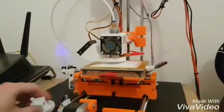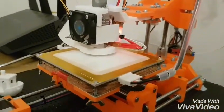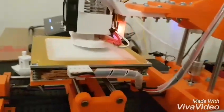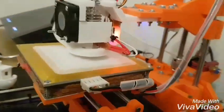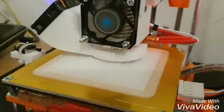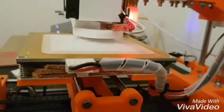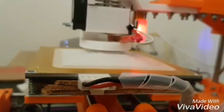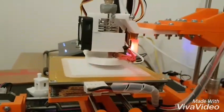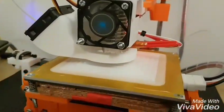Subsequent to the Benchy, we've got another little calibration test on the Atom X. This is like a pyramid — a very shallow pyramid. I'll just be able to measure whether it's 10, 20, 30, 40, 50 mil across. It's an 80 mil square. You can see it's flat as a pancake — the auto leveling is working perfectly. I'm going to attach the config to this video.